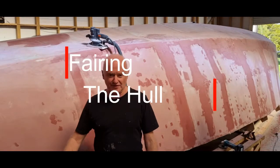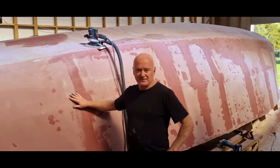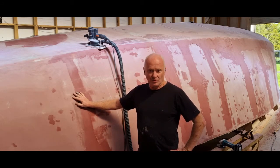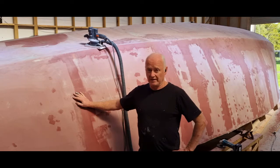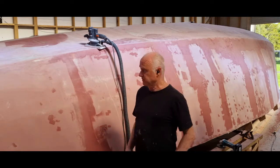Back again — fairing the hull. That's everybody's favourite job: sanding back and longboarding the hull, and using copious quantities of bog to get the boat fair and looking sharp. But there are definite techniques and principles you're going to engage well prior to this to make sure you minimise the amount of bog needed. I've been through those before but let's explain it again.